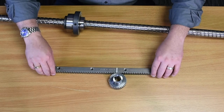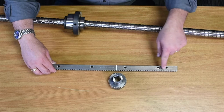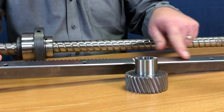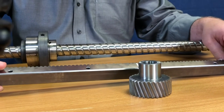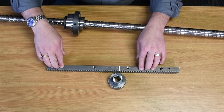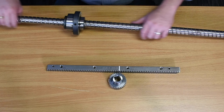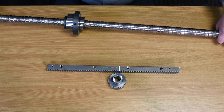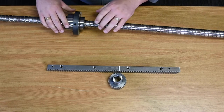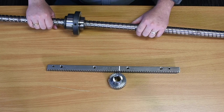I want to point out these fastening locations on this helical rack. We have multiple locations that, once this is positioned up against the datum that's machined into our frame, it provides 100% security for this helical rack. Versus when you have a ball screw, it's attached at the ends — so the further it is out from the attachment, the more you're susceptible to whip, especially as you do higher accelerations and faster speeds because of centrifugal force.